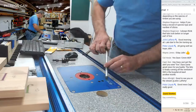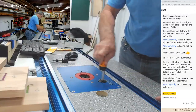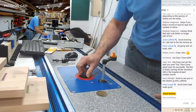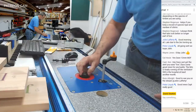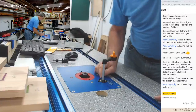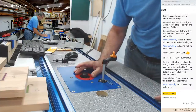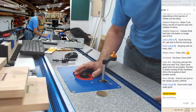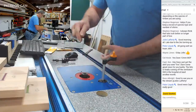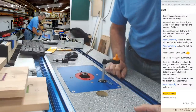And because a Triton router has all this stuff where you have to raise it all the way up to lock it, I'm going to show you what I mean. The router is disabled at the moment. So I'll raise it up, and it'll lock there. See that? Now, I can undo and all that stuff there. It's kind of counterproductive having a Triton router in the Carbotec lift. If I had another router that was a soft start, it'd be straight in because it can come up to the top and you can use two spanners above. But I was doubling up on everything all over the place. So I decided it might be better if I leave it out.